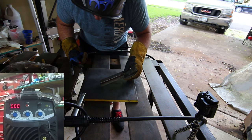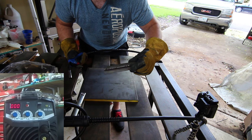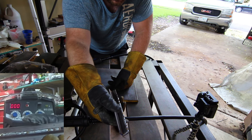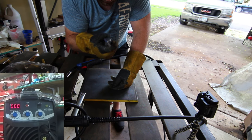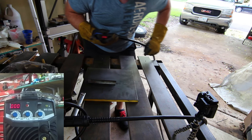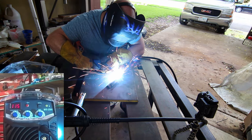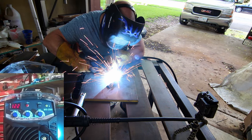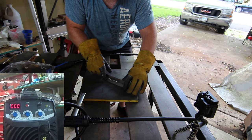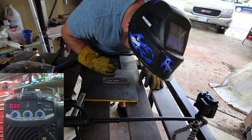Wow, that actually puts down a really nice bead really quickly. On the GoPro you can see that is a really smooth bead with really good penetration. On eighth inch steel at only around setting three on voltage and wire speed at about four, this thing is just cooking. Turning it around to face the camera — these are basically textbook MIG welds with pretty good penetration, not running on top of the surface.